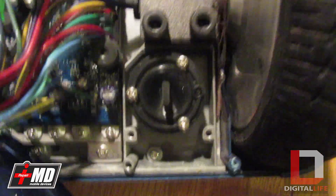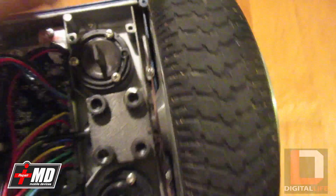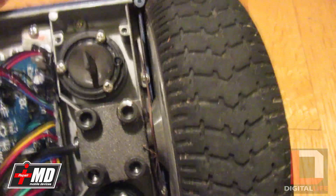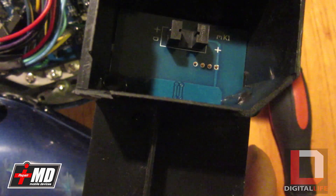These are pedal pressure sensors. When you apply pressure front or back, it blocks the infrared light. The infrared slits are here — there are two infrared light bulbs, front and back. When they are communicating, similar to a garage door opener, it will apply or stop power accordingly.